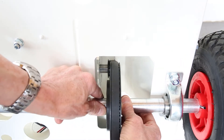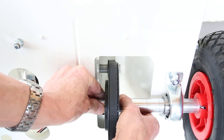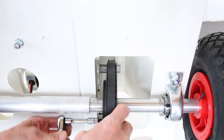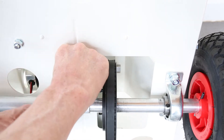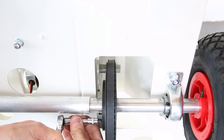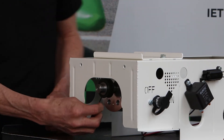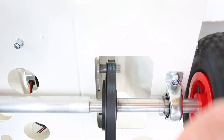What I'm doing now is lining up the two sprockets - and this is before we've tightened our taper lock bush - so I want to get those aligned so the edges of each sprocket come into alignment. It's a very fine adjustment, and now once I'm happy with that, keeping it in the same position, I can tighten the two grub screws in the taper lock bush and that will lock the taper lock bush and the sprocket to the axle. These need to be done up fairly tight. Now we've got the axle sprocket aligned with the motor sprocket, and we've got to remember that whilst that's tightened up, we only gently tightened the grub screw on the motor sprocket - now is the time to go back and fully tighten that. Don't forget to do that because otherwise your motor sprocket can slide on the shaft of the motor and cause your belt to fall off.